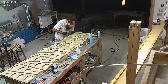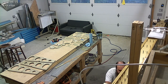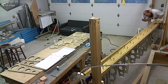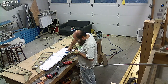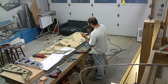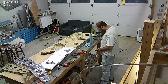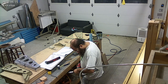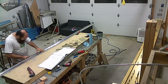That's with the doors fully open and I also have the fan going in the window in that room, adding a slight amount of positive pressure to hopefully get most of the overspray out, but it still makes a big mess. We're doing the first fitment of the ribs on the spar. We primed the ribs that have flat brackets on them because I wanted to be able to rivet those in place. Those are the ones with that green tint - the primed ones - and you can see brackets attached to the ends of them. Those are really burly flat brackets; I'd say those little pieces of aluminum are about an eighth of an inch thick.